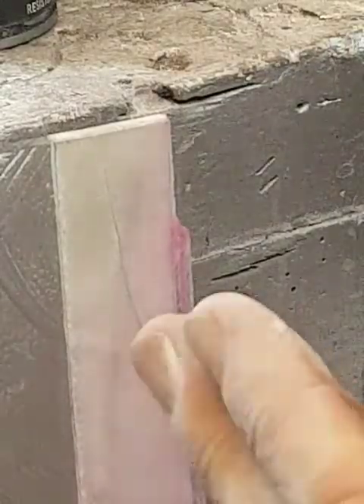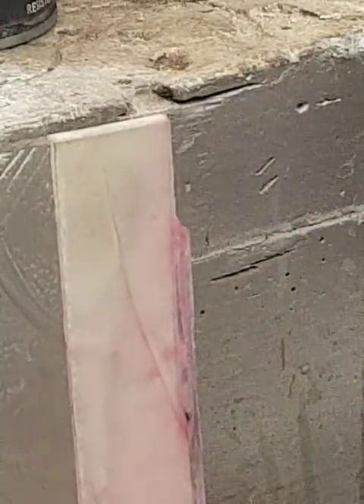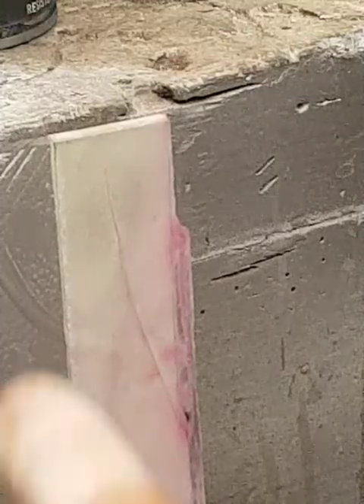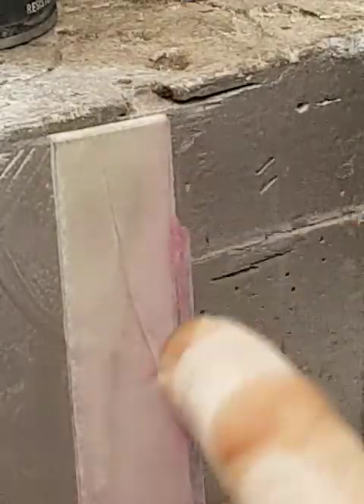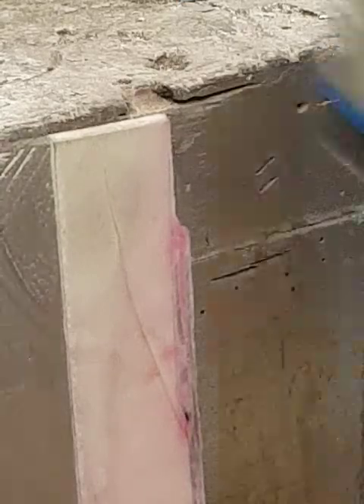As an engineer, I think the reason this is working and hasn't shattered already is because I'm avoiding any sharp corners. Filing is safer because you've still got a fairly straight regular edge. As soon as you get a crack started, just like any fracture in a hard material, it's going to open up real fast. So by filing down from the edge it's going to be a lot safer. If you wanted to cut out a hole for something like a pet flap, it might be a lot more difficult because you've got to really make sure you're not creating fracture lines - a lot more coolant would be necessary. Heat is your enemy; if heat is building up it may trigger a fracture. So keep everything cool with a low power, low speed approach.